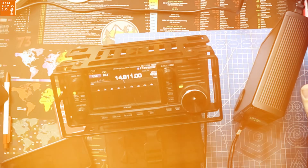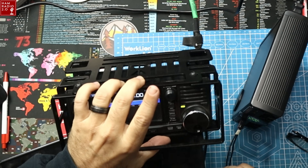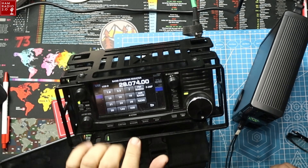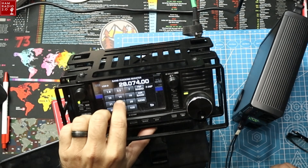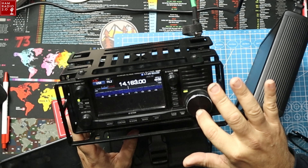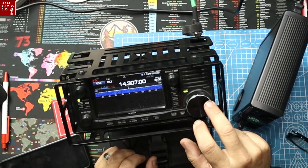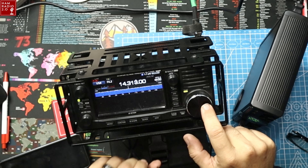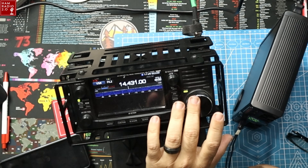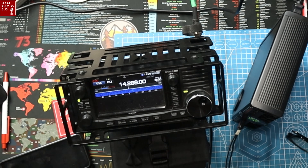Now I've got an antenna plugged in — just kind of running out of the shack, not really tuned for any band, just a receive-type antenna. On 10 meters the scope looks fine; going back up to 20 meters, that's a very clean scope — no birdies. Down lower it's even quieter. There's a little something there of course because it will pick up signals, but there's no RFI interference. As we change frequencies the scope changes a bit, but there's nothing very strange up at the top of the 20 meter band. This seems to be pretty RFI quiet.